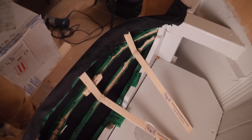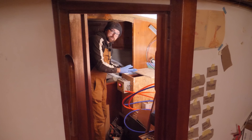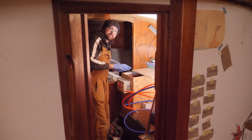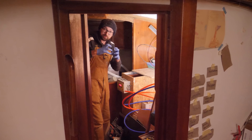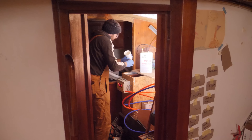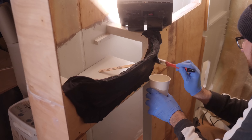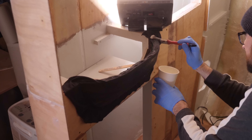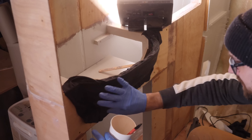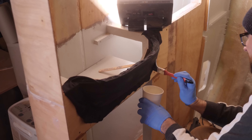Here's a quick peek of the inside. I've preheated my epoxy in the little heating box here — it's just a wooden box with a silicon heating mat inside of it. I've done that in the hopes of lowering the viscosity of the epoxy to make it easier to soak it into the fleece. Yep, this is basically the viscosity of water. This is definitely gonna take a little bit of time, but hopefully tomorrow when I come back this should have stiffened up so I can use this to lay up a little bit of additional glass to reinforce it and maybe put a bit of foam on the inside, but we'll see what it looks like tomorrow.